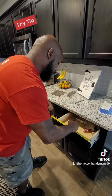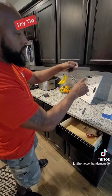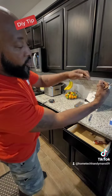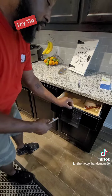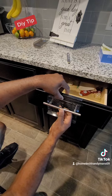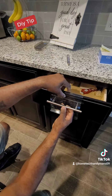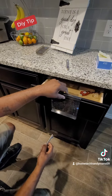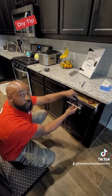Mark at nine inches, then take the template — I've already marked the holes at five inches. The center point is right here on the template. Place that center point right on the mark you just made, then position the template wherever you want your pull or knob to be, and that's where you put the holes. I would drill all the holes first, then come back and do the easy part of putting the screws in.